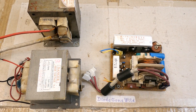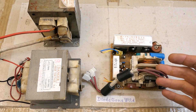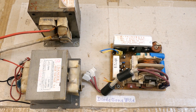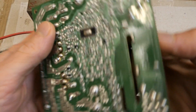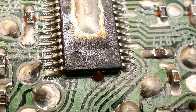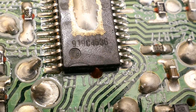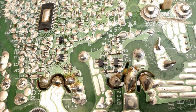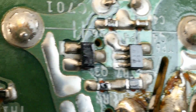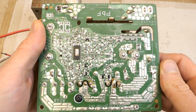You don't even have to touch it to get a shock — this voltage can break down insulation or you can get in the way of a discharge. The switching equivalent is quite interesting; I'm curious what the operating frequency is, and whether power is frequency-modulated or pulse-width modulated. Not having the rest of the microwave oven and with the module being faulty, this reverse-engineered schematic is probably the best I can do. The main chip has a marking that looks like '919C4536' but searching for that type number gives no results. Each IGBT seems to have two packages — a 3-pin and a 5-pin — next to it, probably for gate drive.